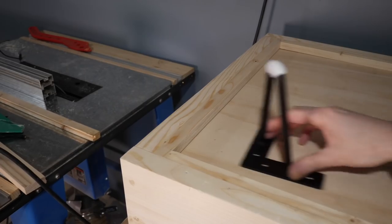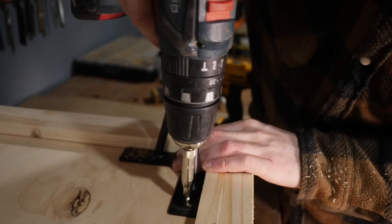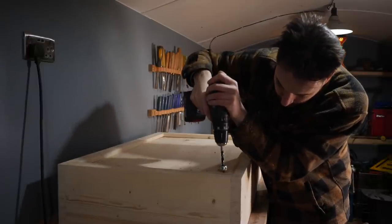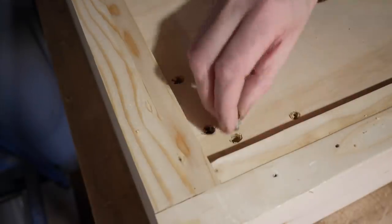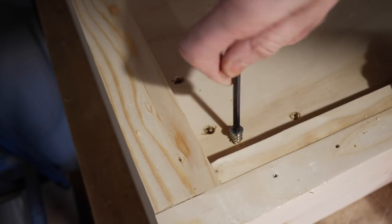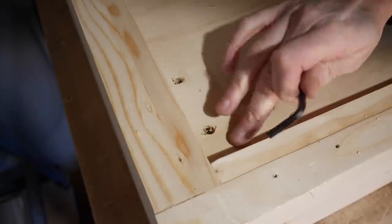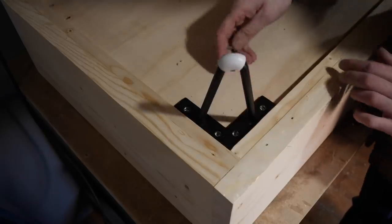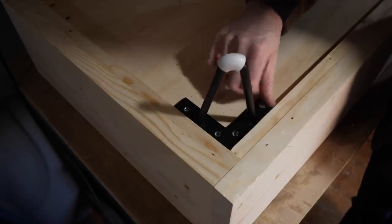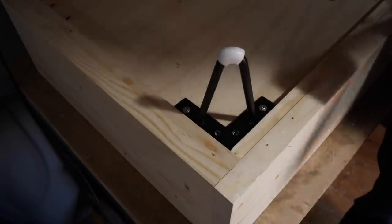The design I was sent had some hairpin legs so I got some of these 6 inch ones off Amazon, I'll put a link down below to them. I use a self-centering drill bit to mark out the holes and then a larger drill bit to widen them so I can get some screw inserts in. The legs came with their own screws but I want to use these inserts and some bolts so that I can take the legs off for when I package it up and ship it. Then Harry can get his assistant just to screw these in place.